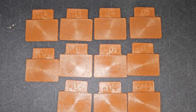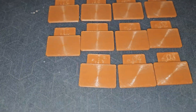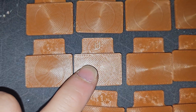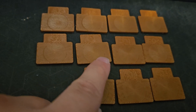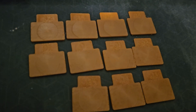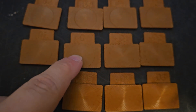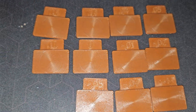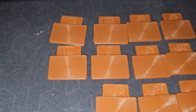For the K1 Max, I just did a flow rate calibration with the new circle pattern from Orca Slicer. The camera doesn't pick it up that well, but I feel like zero is the best performance here. Looking at zero, it has some gaps. Zero one has a gap, but it's a little bit smaller — maybe it's between 0.02, 0.01, and zero. If I go with zero, I don't have to change anything in the settings. So for now, let's go with zero and do another test.